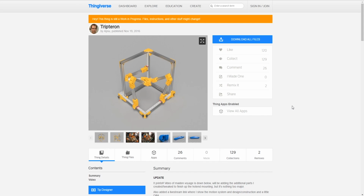So you go onto his YouTube, and you'll see a whole bunch of kinematic systems that I've never seen implemented into 3D printers before. But to me, it seems like he likes the Tripteron the most. But he has all different types, even Cartesian, the normal, vanilla kinematics. He also has circular, polar, angular, and other non-linear kinematics that you've probably never seen before.